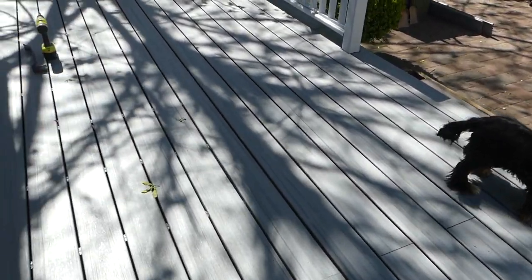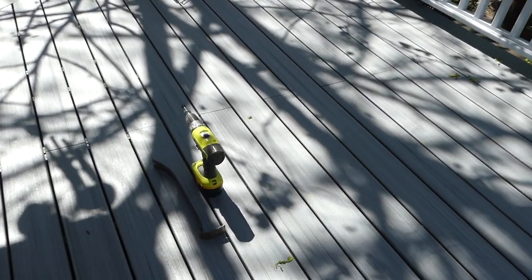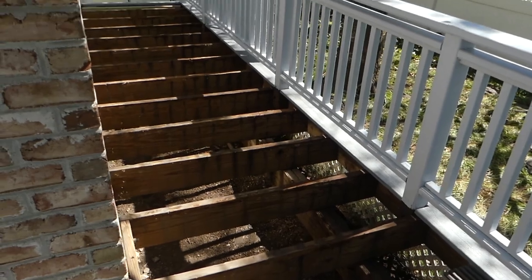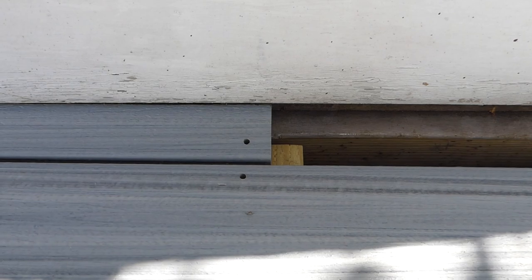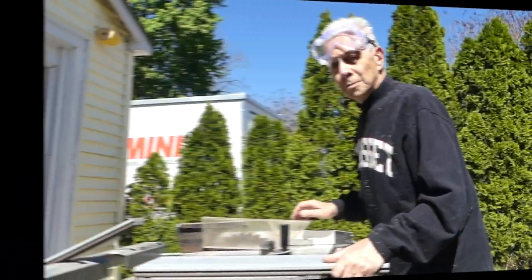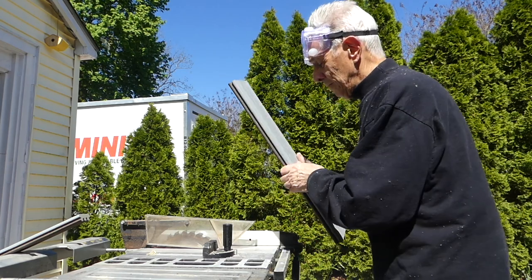We got a nice sunny breezy day and between all the rainy days we had, I've been able to actually get the main part of the deck done. I will still have to do the side part of the deck and the step in front. But if you look closely, there's just one more little board to put in place, and this last board has been a little challenging because it has to be tucked underneath the outer layer of the house — the living area — so that we get proper drainage. That means ripping a piece of the regular width deck wood into a smaller width. I've got this piece cut to the proper length and I have my table saw set to a three inch width, so all I have to do is rip this.